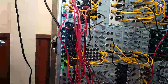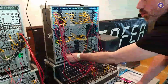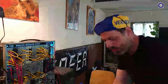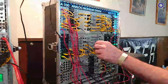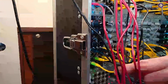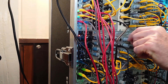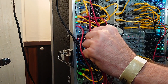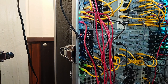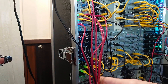Should we just hear it in action? We've got two synced oscillators going into a filter which saturates and distorts a bit — it's the sine waves. With hard sync going now. You can also have them independently, though the tuning of the slave oscillator is a bit uncertain at the moment.